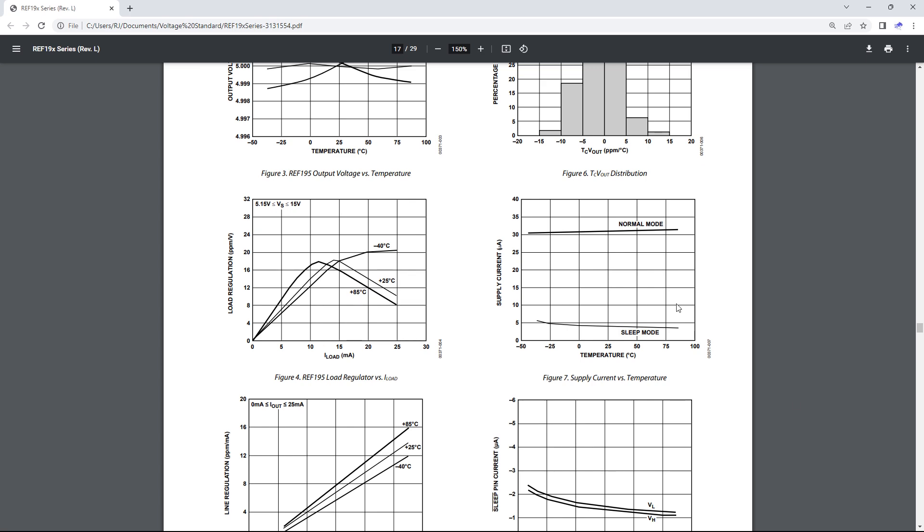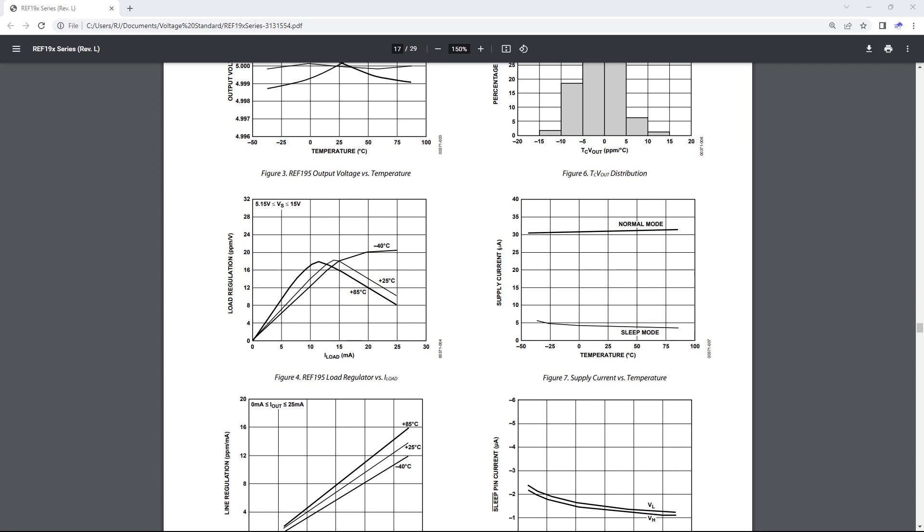What I have in mind instead of a nine-volt is just using a couple of CR2032s. They're nominally 3.1 to 3.4 volts. There are some caveats with putting these batteries in series, but in our case none of those really apply. We're not pulling any current to speak of, they're not rechargeable batteries, so we're not going to do anything that would be an issue with two of these in series. My thought was let's just put a couple of coin battery holders on the circuit board. You pop these in, and with a push button on the unit to activate it, there'll be no current draw except when you're under test. These batteries will last probably a thousand hours of operation.